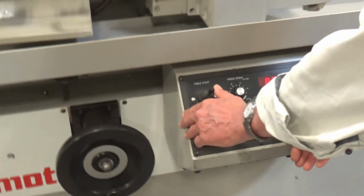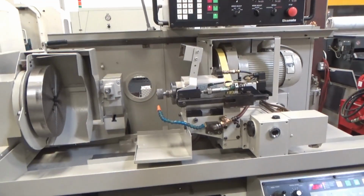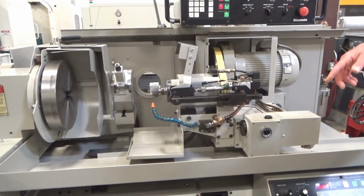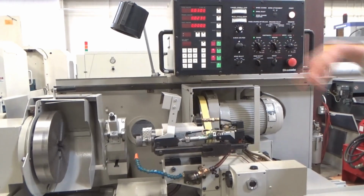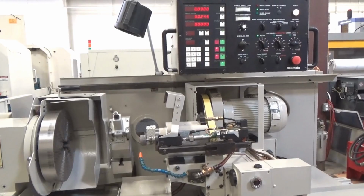So I'm going to auto start. Right here, it's a 2-hand interlock. Dresser comes down, we're dressing. So I call for initial and intermediate. So now we're rough cutting at, what have I got it at, 5/10? 5/10 per recip. You slow it down a little bit.